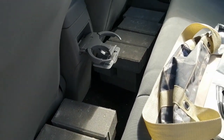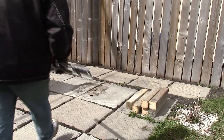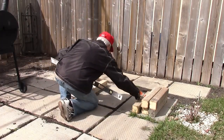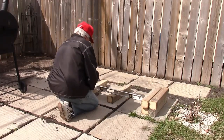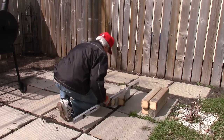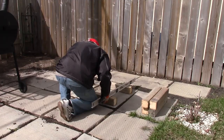We're going to set it up in the yard. I decided to place it on an old pad where we used to have a tin shed — it had a lot of sidewalk blocks, so it looked like a great spot. I wanted to make sure it was level first, so I'm leveling it out and putting some shims on those four-by-fours.